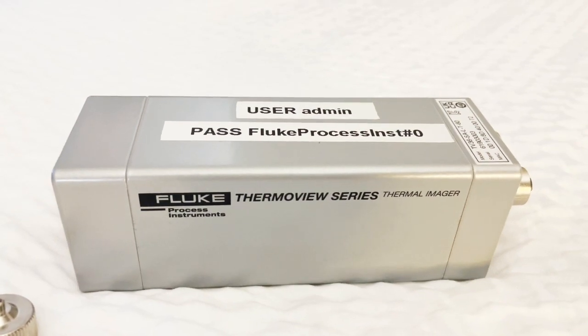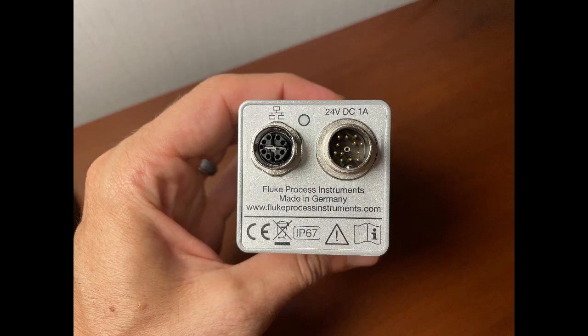Now we're going to look at the back of this instrument, and we're going to talk a little bit about what you can get out of this tool. So you can get out 3 different things, or several different modes. You can do a 3 digital output, like a relay switch, where it just makes a connection, and you can do 3 of those just by buying the cable with it, and it'll output to your PLC or whatever.